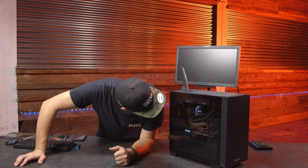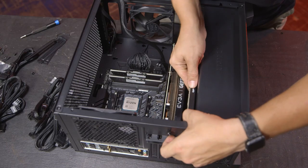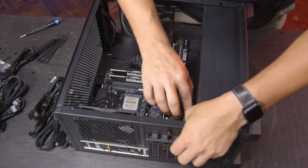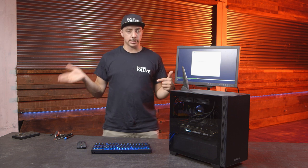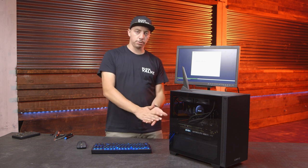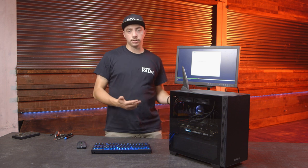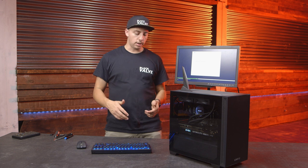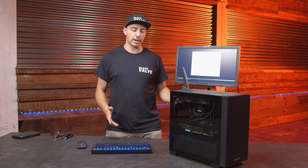Good morning. So in this rig, we have the Elgato Cam Link Pro. It is a 4-channel in HDMI. So that works for us in OBS very nicely. We'll feed it our C300 cameras, which have a SDI out. And on this end, we'll have a couple of Blackmagic micro converters and convert from SDI to HDMI. And it's really nice because you can run the SDI up to around 200 feet or so. And have long runs right to the computer and then switch within OBS and have a multicam setup.